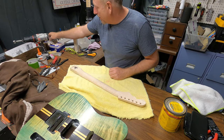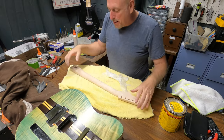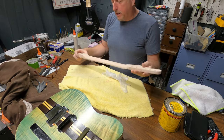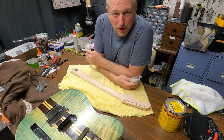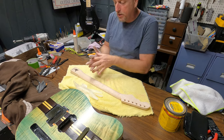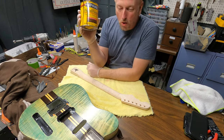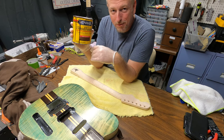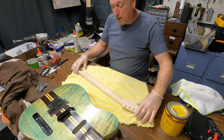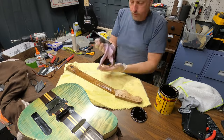While I let the glue dry on those magnets, I'm going to do a little interjection on staining. I'm going to be staining the neck for this guitar. I got a flamed maple neck, and I really like the look of roasted maple necks. What I don't like about roasted maple necks is how brittle they are — they're dried and they crack easier. So because this has dark wenge in it, I'm actually going to use a dark walnut stain. This is not the typical stain I use on my guitars, and then I'm going to go with another color over top of it. I'm experimenting here, but I think we can get close to that roasted look.